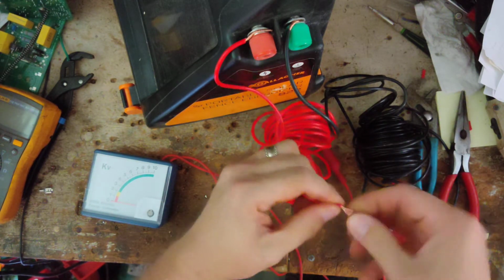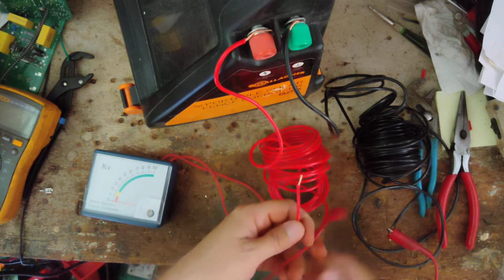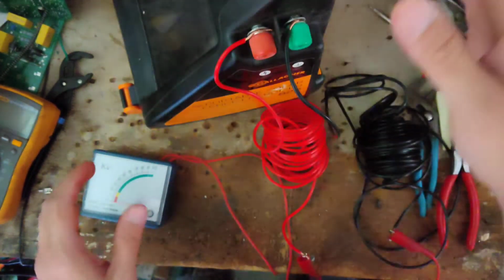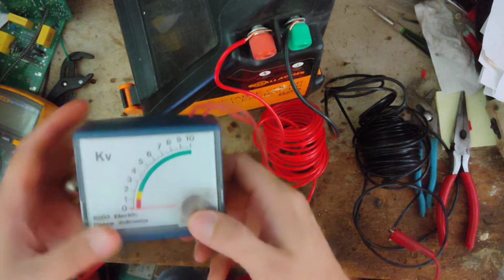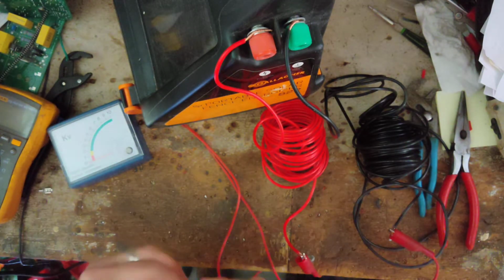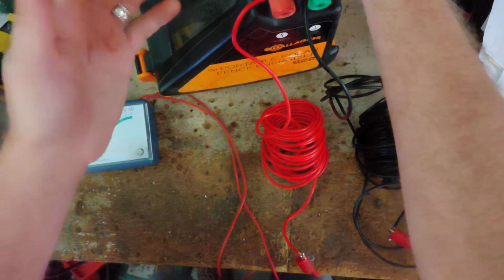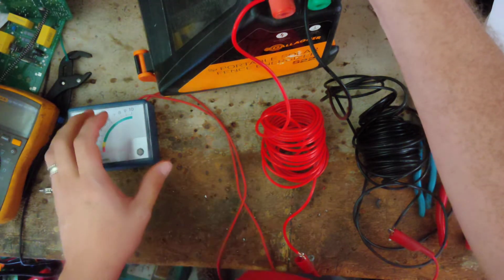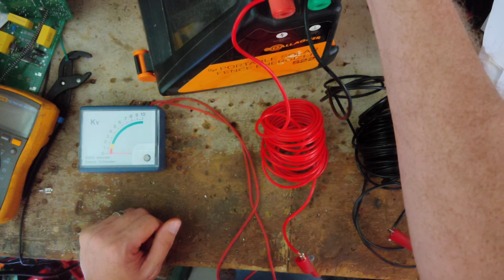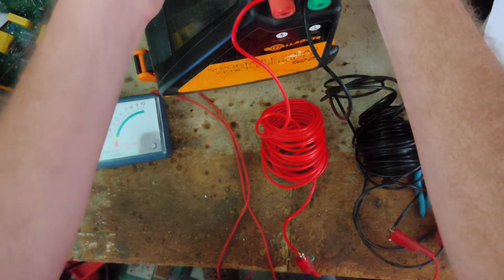and what this should do, should go up by at least 1,000 plus volts. Typically that's what's going to happen, because what it's doing, it's allowing that discharge to spread out a little bit more, not by much, just a little bit. Allow these testers to pick them up a little quicker. Gallagher actually had to make a newer version board on their testers to compensate for those readings. And Gallagher actually had to change their cheat sheet that they use for voltages and stuff to tell you what they're supposed to put out.